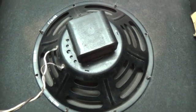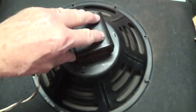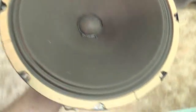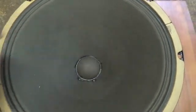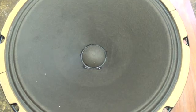One final bit of disassembly — and this is the icing on the cake. After my luck lately with speakers, I have undone the nuts but haven't lifted this or even looked at it yet. It's either going to be covered with masking tape, torn to shreds, something. But let's take a look. Oh man — it's just about perfect. It looks great. I'm going to push the cone in and out to make sure it's clear on the voice coil. No rubbing of the voice coil. The cone is in perfect shape with good, solid, firm suspension. This seems like an absolutely excellent vintage speaker, and I'm going to use it. Looks like I finally lucked out — I guess it was about time.